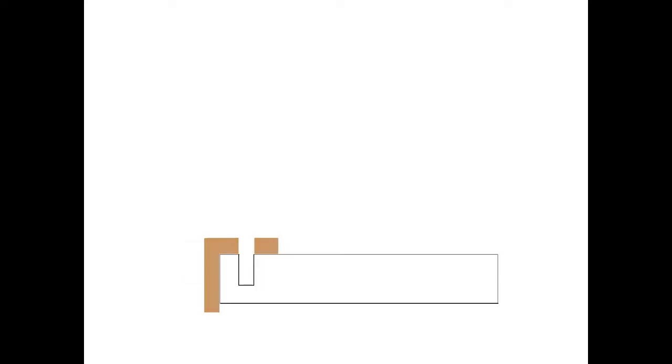When you want to join one part to another at right angles, the crucial point is this one. This means that the dowel has to be an equal distance from the outside face as shown. So the hole has to be measured from this face on the horizontal part and this one on the vertical. If using an angle jig to place the holes, then the jig has to be turned end to end. This means the jig has to be both accurate in every hole and the jig needs to have end stops that can be adjustable. The solution to this is to use a T-jig.